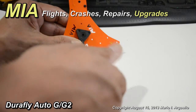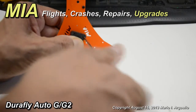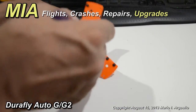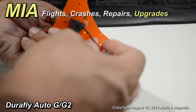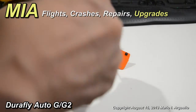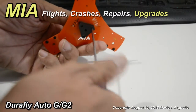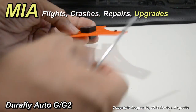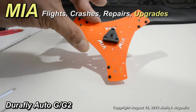Little by little. If for some reason the screw is not grabbing, you need to push the nut a little bit further down. Unscrew it to allow some room for the nut to go down inside the pocket, and simply press it a little bit deeper. That should grab onto the nut — there we go, now it grabbed. Install all three nuts, and the plate is secured in sandwich form to the upper and lower hub plates. You should be set to go.